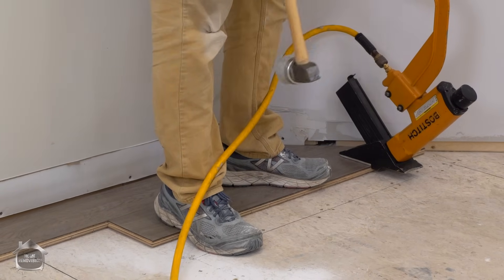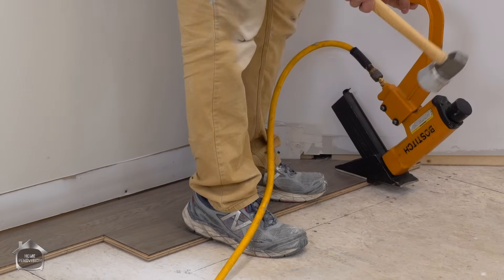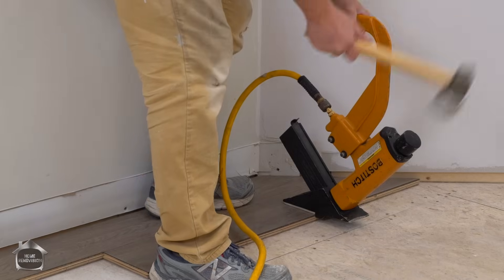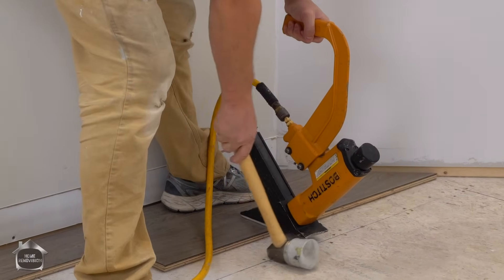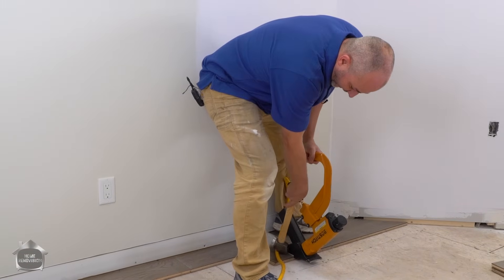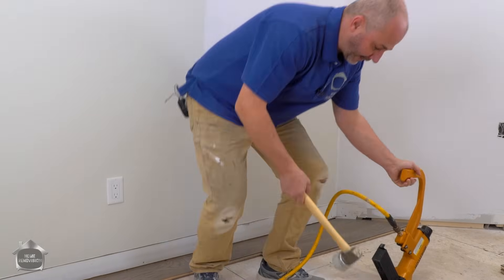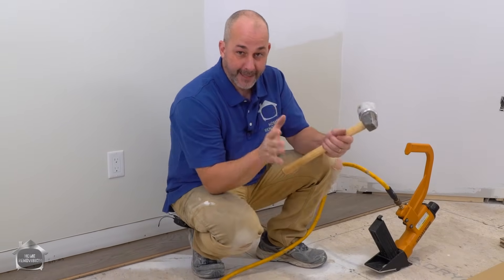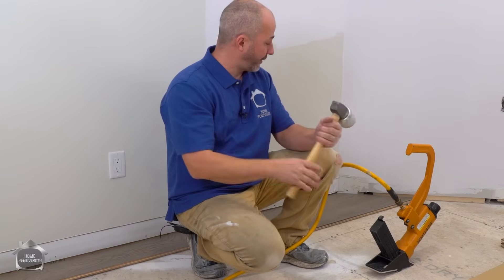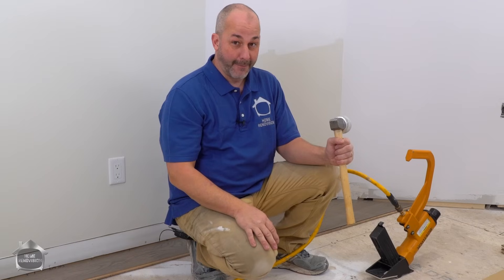Make sure you leave a healthy gap — about half an inch — all around the perimeter of the room. If your drywall is installed correctly that's basically the distance from the drywall to the framing behind it, which makes life simple. Install a staple every 12 to 16 inches; try to be mindful if you're over a joint with a bunch of screws — you can even mark them with a pencil in advance. This is not a race; make sure the plate is set firmly on the ground. It doesn't take a lot of strength — anybody can install their own engineered hardwood. You'll also need some sort of chop saw, 10 or 12 inch, just to cut the ends clean.